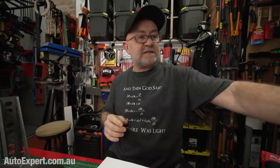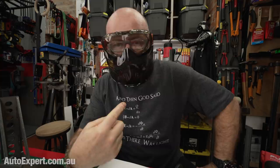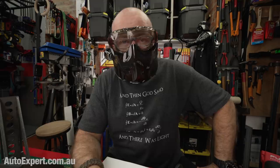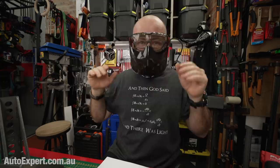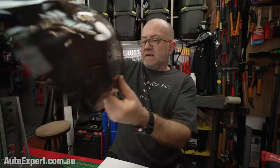A few of you said you wear spectacles, so how the hell do you manage eye protection? You can't wear safety glasses and spectacles generally at the same time. I've got a couple of options for you. The first one, which also includes some decent face protection, is a full-face goggle — a bit of a Darth Vader vibe. You get full face protection and you can wear your specs with unimpeded field of view, and the specs are not pressed into your face. However, they do tend to fog up because of the gasket on the inside, so there's not much airflow through goggle-type alternatives.